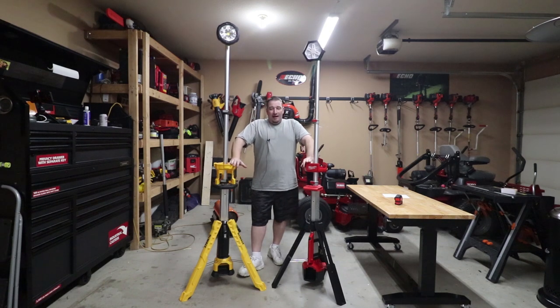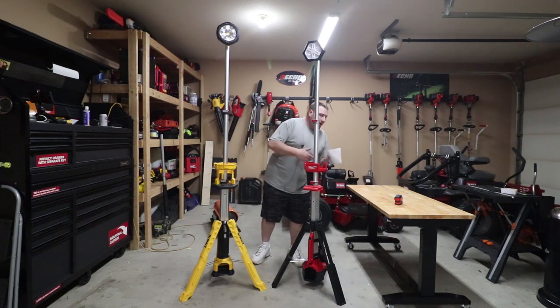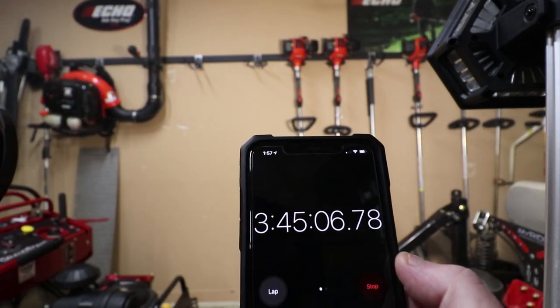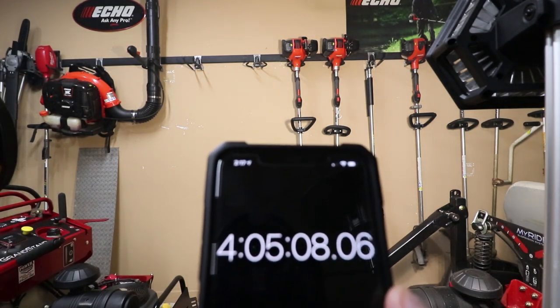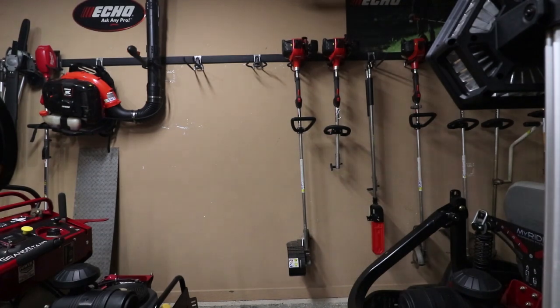I tested these with a five amp hour battery. With the Milwaukee, the runtime with a five amp hour battery was consistently right between four hours two minutes and four hours five minutes, over and over again on high at 2,500 lumens. I did not test it on low or medium — I wanted to give you the high specs, because I don't know many people that buy this light and use it on low or medium. If you've got two five amp hour batteries, this thing will last you all day long on high.